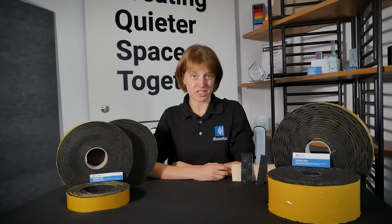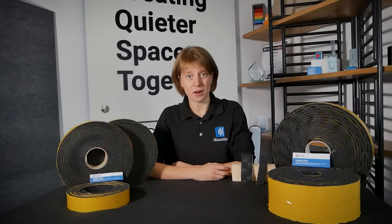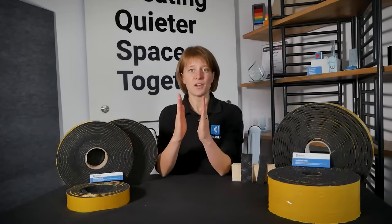The soundproofing secret we'd like to share with you today is to remember to use isolation strips. Now, isolation strips aren't talked about very much, but they're integral to good soundproofing systems. We use isolation strips to help accomplish decoupling in a system. Decoupling is when we have two materials and instead of having them physically joined together, we pull them apart.